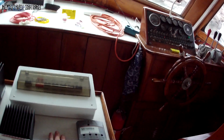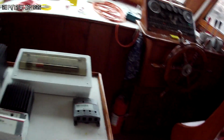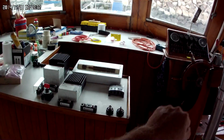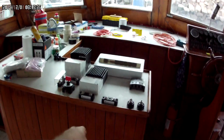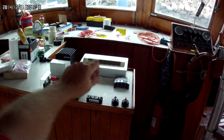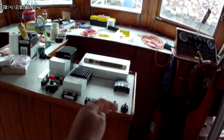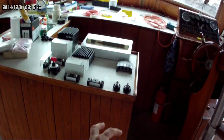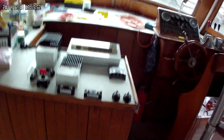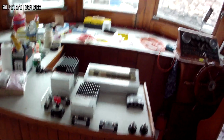Now I'm going to have 2 wind turbines up at the top. They're 600 watts each, so that's 1,200 watts. Normally I have the 3-phase AC come out of the wind turbine, go to a brake switch, then from the brake switch it goes down to the rectifier. The rectifier turns it into DC, and that connects right to my bus bars. So I'm always charging, so they're always under load, 100%, even when you break them, still under load. Perfect.